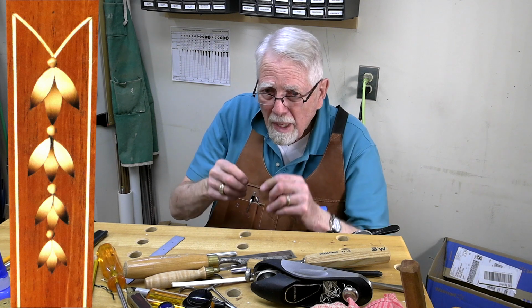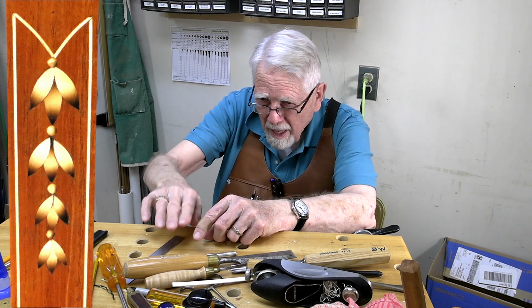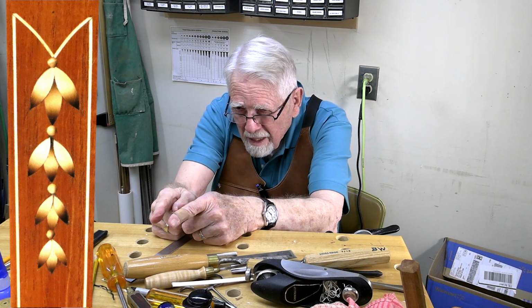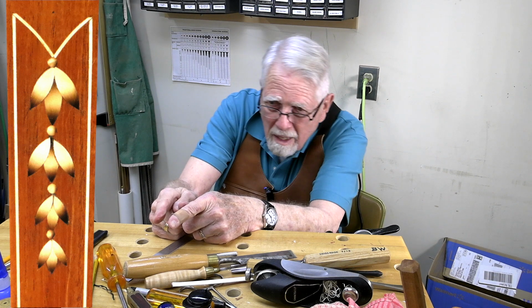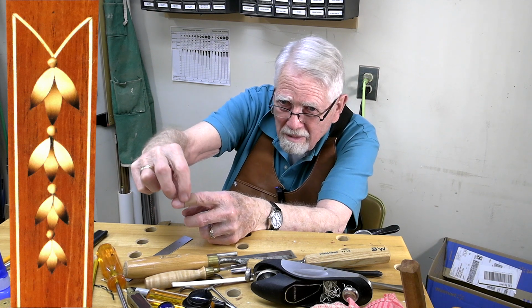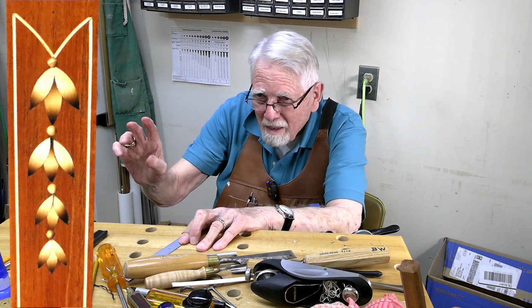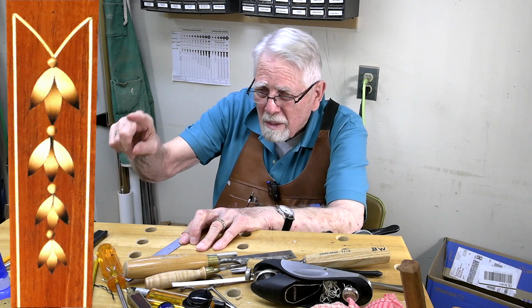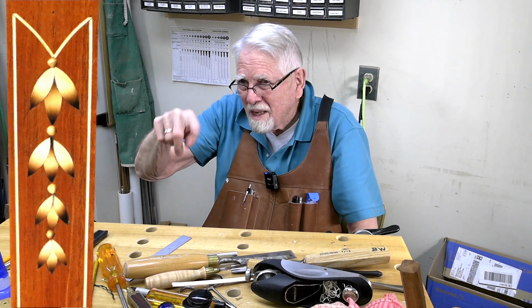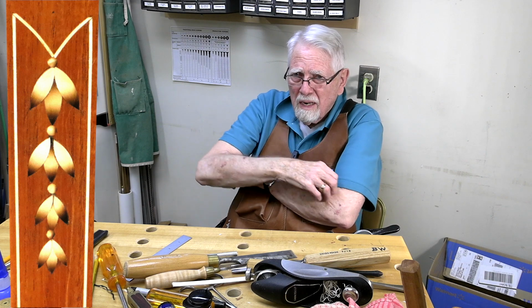And so what I do, I got it in the drill, and I got the drill down, almost. I set the table height so I'm only maybe an eighth of an inch above the leg. So I can look at the drill. I say, is it in the center? You know, I can move it side to side to get it centered. And I look around the corner. Is it touching the top and bottom, the 3 millimeter that I left there? Is it covering that? And I get it like that, and then I just go just a little. You don't have to go over. Well, I drilled it a little deeper, and it's all right. You can push the little disc in. It doesn't have to bottom out. You know, it just glues around the edge because it fits perfect. If you look, you'll see one or two of those are a little bit off center, if you look real careful.